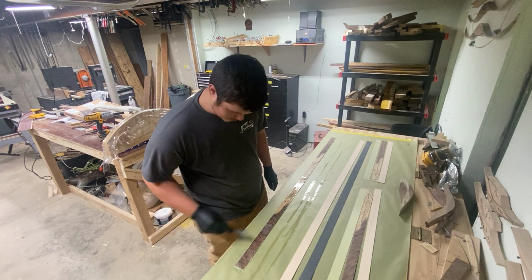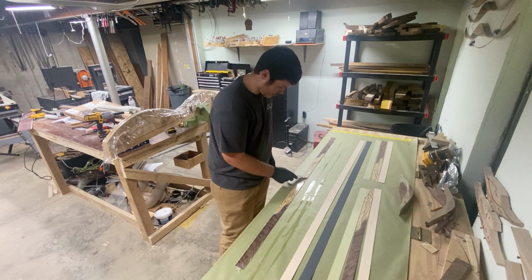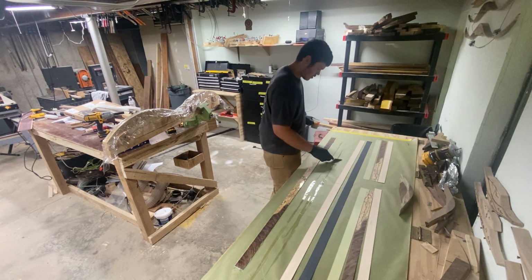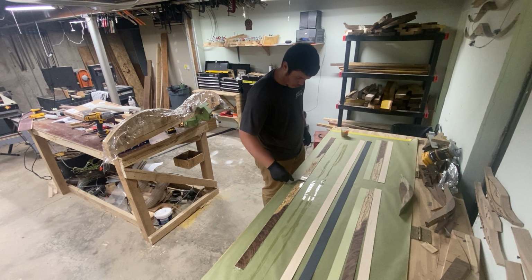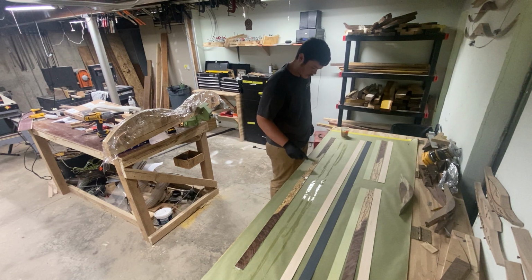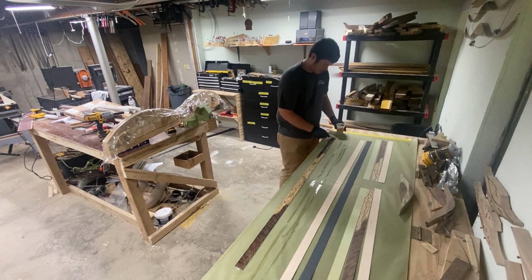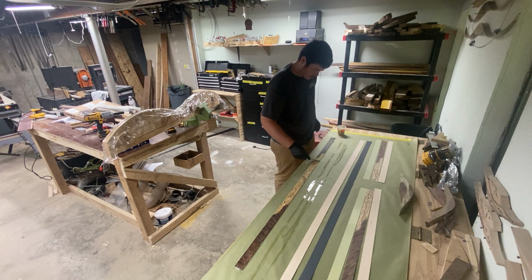You got a hard chunk. Get that out of there. You can kind of see on the wood when the glue soaks into it, it wets out. Because under the pressure of the form and the heat, the glue actually soaks through all the way through these veneers for the most part, which really helps strengthen everything. And that's how you can get away with using really cool looking wood that's maybe not the strongest grain, because it's completely saturated in resin all the way through in this process.